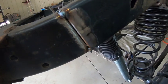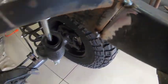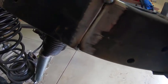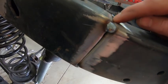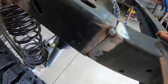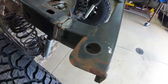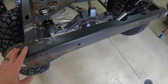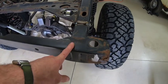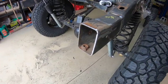I've got this basically just tacked on all four corners on both sides. I chamfered the edges of the metal so when you butt weld, the weld lays down in there for a stronger butt weld, and then we'll put a fish plate over the inside and the outside. Next thing is to cut this back cross member off because I'm not going to be using that, and then set the body back down to figure out how long these need to be.